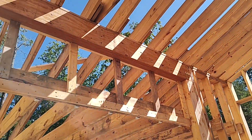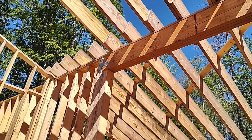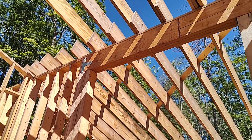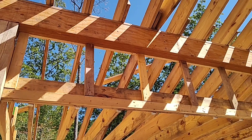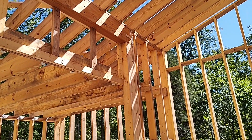This is just a reminder of what the LVL looks like in the kitchen — we're basically going to do this same thing on the bedroom side. So this is three 1.75-inch by 11-and-a-quarter-inch LVLs sandwiched together, and that's what we're going to do on the bedroom side as well.